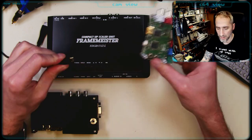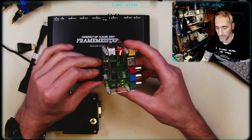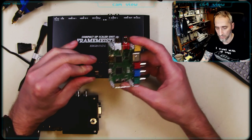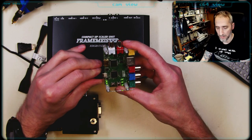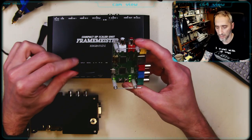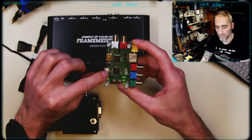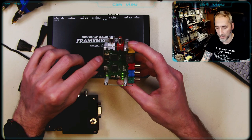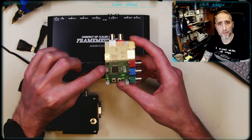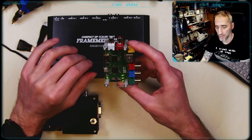The connector itself is not really something you put mechanical stress on, and it moves into the socket for just a few millimeters. And if you move this around a lot, or if you maybe have a stiffer cable, then it is very likely that you rip off this connector from the board, since there is no mechanical support for the USB, neither for the HDMI socket.